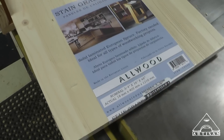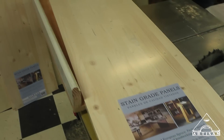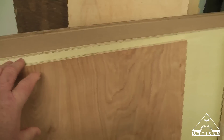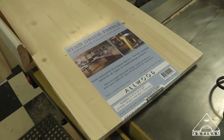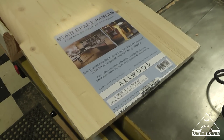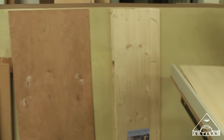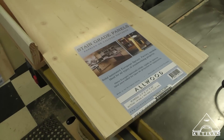Our cabinet dimensions are 16 inches deep, 46 inches long, and 24 inches tall. To make it quick and easy, I bought a 24 by 48 piece of cabinet grade plywood and these three pre-cut shelves. I could have just bought large sheets of cabinet grade plywood, but I'm going to save a lot of time not having to rip down and all that. This project is getting painted.